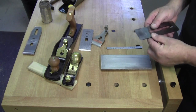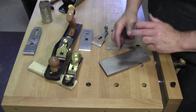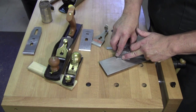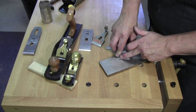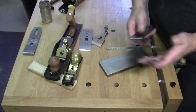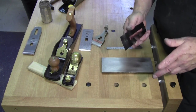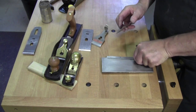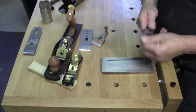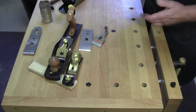Then as far as sharpening, whether you use a jig, whether you're using diamond plates or stones or sandpaper, none of it matters. You already have a factory fresh bevel. You just simply find that bevel, come up, give it a little kick, a little higher, just a little higher, and you proceed to polish that front edge. There's not a lot of work. Within 2 minutes, I would be surprised if it took any longer than 2 minutes out of the package to be making shavings. And you come back here with the ruler trick and you take the burr off. Burr's gone, burr's gone. That's it. You use your sharpening method, and that's all we're going to say about that.